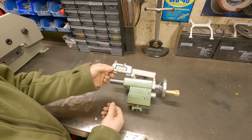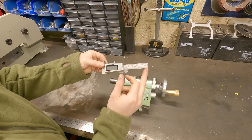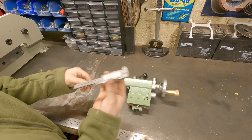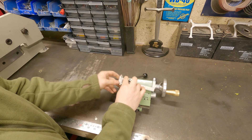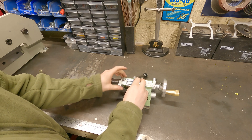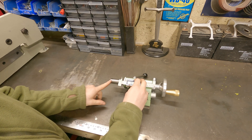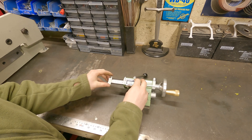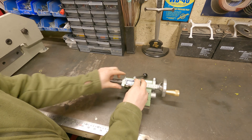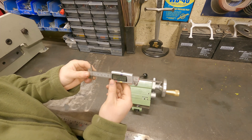The caliper is all cut down — that was a really simple thing to do. I just chopped off the caliper end which I won't be needing, and I chopped it at 140 millimeters which gives me plenty of room to maneuver. The next thing is to somehow mount this on here. My plan is to bolt this part to the actual tail stock itself, then make a little collar that goes on the end of the quill. When I wind the quill in, this will slide in with it, and when I wind it out, it should move out with it. All that's left to do now is start machining.